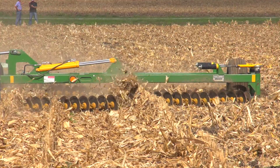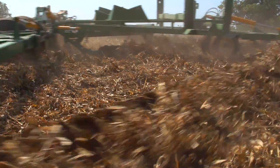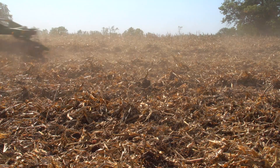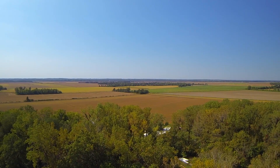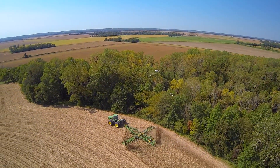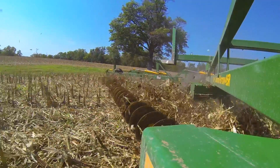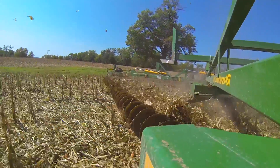What it actually does is it hugs the ground so faithfully that you can't believe how smooth a job it does of preparing seedbed in undulating terrain, on flat terrain — it doesn't move soil around. You get into rolling country in Missouri for instance and it just follows the ground over those levees, over those contours, through the valleys and the creeks so faithfully and still performs a beautiful job of levelling the seedbed.